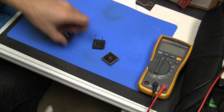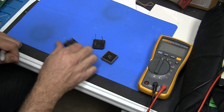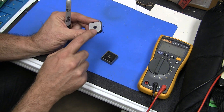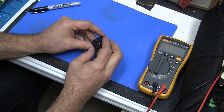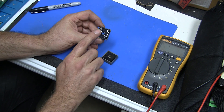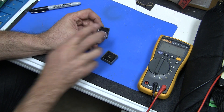Looking at the rectifier, it's basically a set of four diodes. This is your common one — you'll see sometimes they'll have a little corner missing. That indicates where the positive terminal is. Once you know where the positive is, the one opposite it is the negative, and then the other two are the AC connectors.